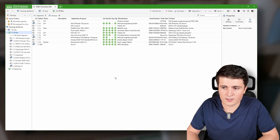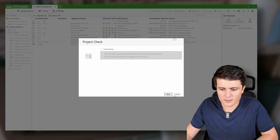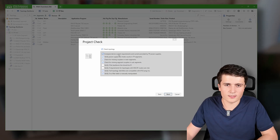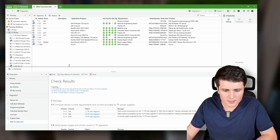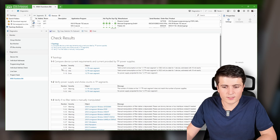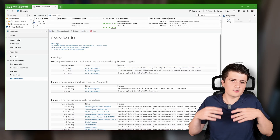Another option is to go to Diagnostics → Project Check, and check the topology by comparing device current against the power supply. It's important that you have also added the power supply. After running the check, line 1.1 shows a total current consumption of 135mA — again confirming roughly 138.5mA — with no error since the power supply capacity exceeds that value.